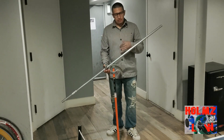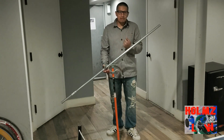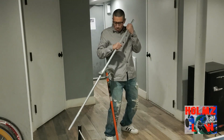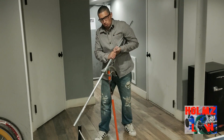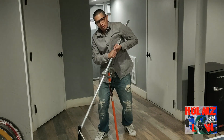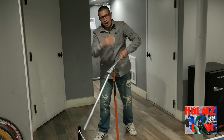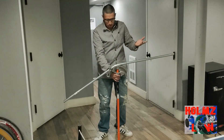You have a 10-degree mark so you only need an 11-degree bend — you can take it to 10 and adjust accordingly. There are two ways to do this: you could put your knee on it and pull down, or the way I like to do it — for more control — is to put it under my armpit, grab it with two hands, apply pressure, lower my knees, and bend it that way. We're going to take it to 22.5 degrees, trying to stay parallel to the lines on the bender.